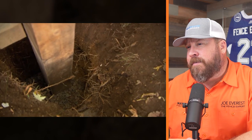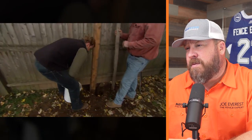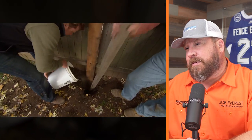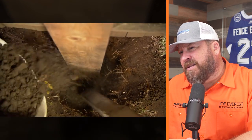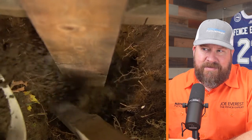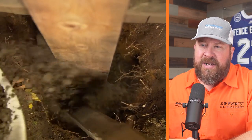They're using a mixture of three-quarter stone and stone dust, packing that around the post to hold it in place. I don't know that that's accurate. Stone with fines — what he's calling stone dust — once it's compacted like that, it doesn't drain. It gets pretty solid. We use it on our lot. I don't think crushed stone dust with rock — rock with fines — is going to drain hardly at all.